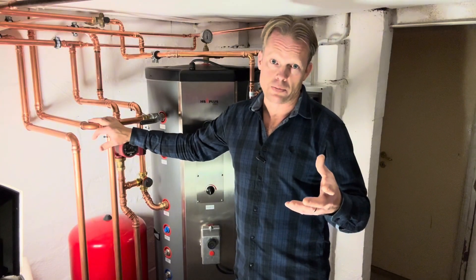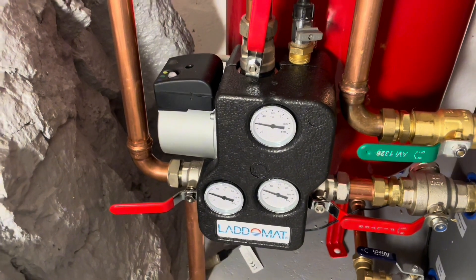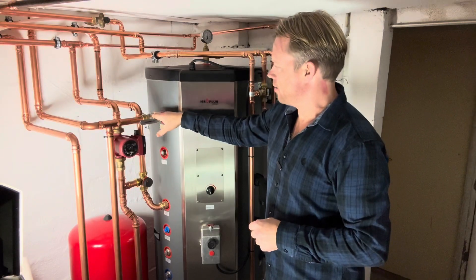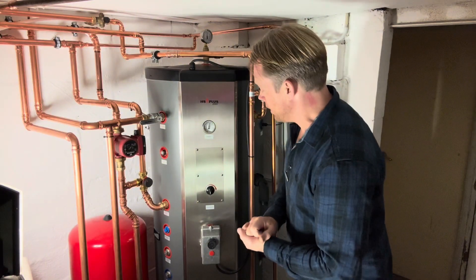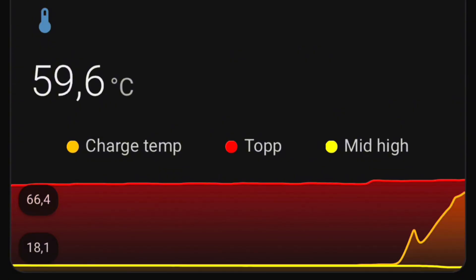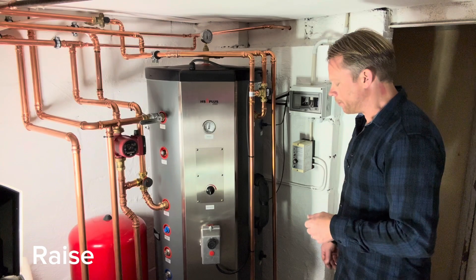Once the charging pump starts, we begin circulating water through the pipes. When the water temperature reaches 70 degrees, a thermostat in the charging system opens and water starts circulating into the top of the tank, releasing its energy from the top down, slowly heating up the tank. You can see this in Home Assistant — I have a graph where the orange line shows the stove temperature rising, and shortly after, the yellow line showing the upper-mid tank sensor also starts to climb.